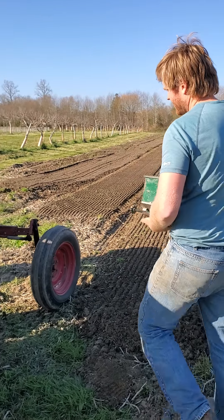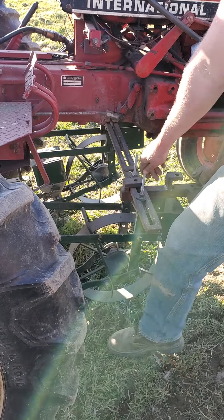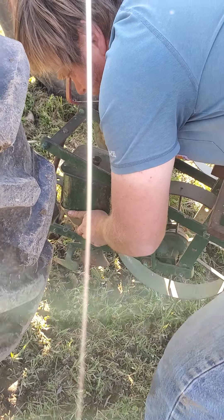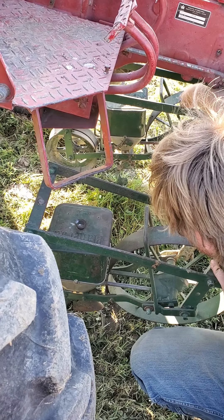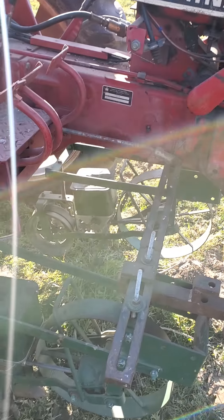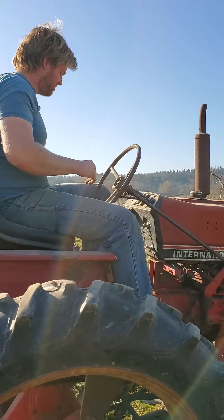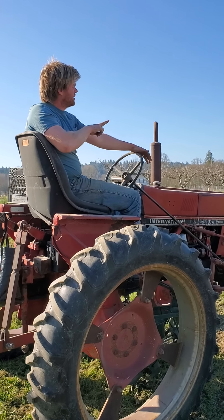Come over here and I'll show you how to hook this thing up. This is my little seed box that I can take out. This is the wheel — the ground drive. There's a little shoe right here that makes a little divot in the ground for the seed, and this little wheel back here covers up the seeds when they're planted. This box sticks into the wheel and clips in. Then I give it a little turn to make sure the seeds are falling out. There should be two rows when I go down, 26 inches apart.